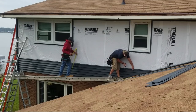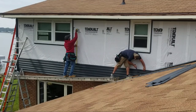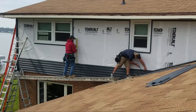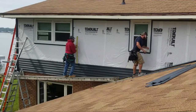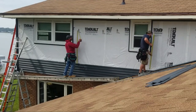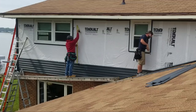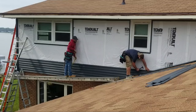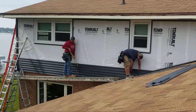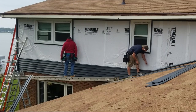What we're using to cut these angles is a grinder. Now I've got a mark here. I can check this number too. Okay. Looks like I'm running a little high on this side, which is very common when you get this angle in here. It's easy to let that run high because it'll move. So just give that a little tap down.